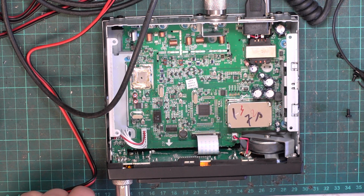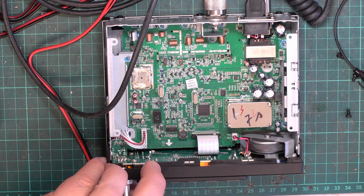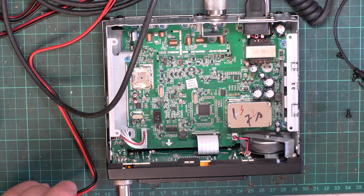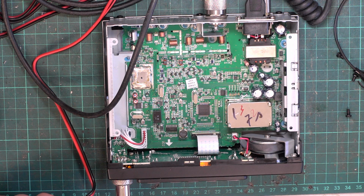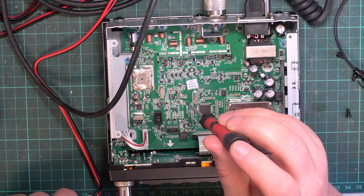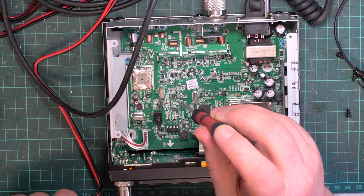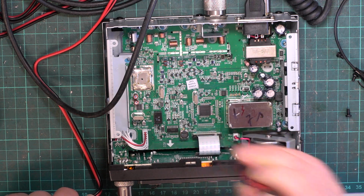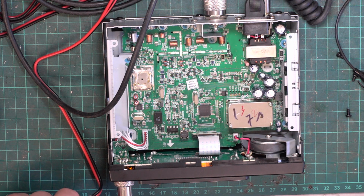So when does it come in? Well, never. Oh, it does. I'd knock the volume control. 3 millivolts. Far too much. So I need to drop that until it opens for S9, because that's how I want it to be. That's now exactly S9 where I want it.